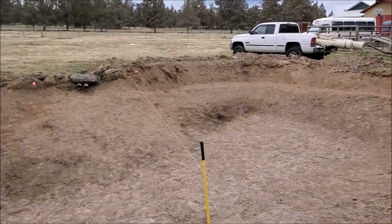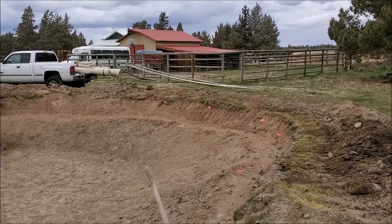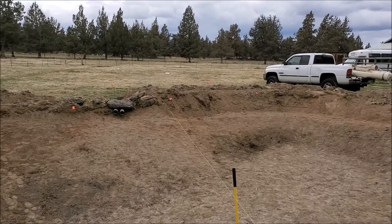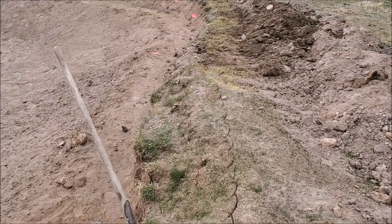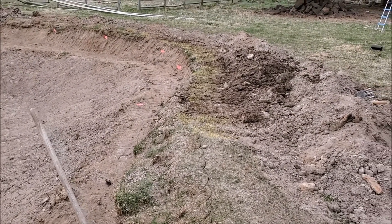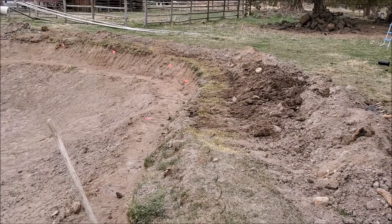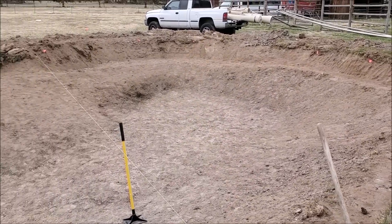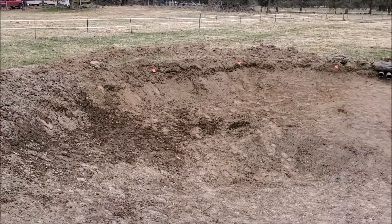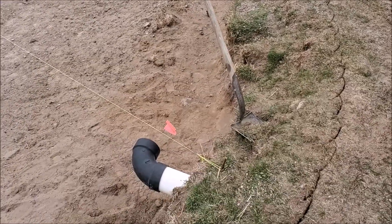What I did — I was going to just wrap it over the top and throw some rocks on top. But I decided instead I would chop off a shelf for it to stack rocks. I ran a string across, found level, and marked with some pin flags so I know where it's at. That's about the top of the pond, a couple inches above the top of the fill.